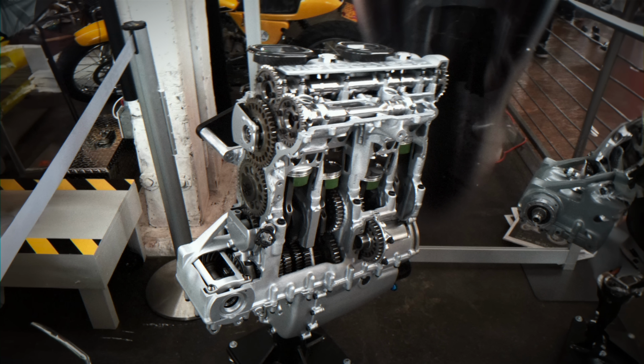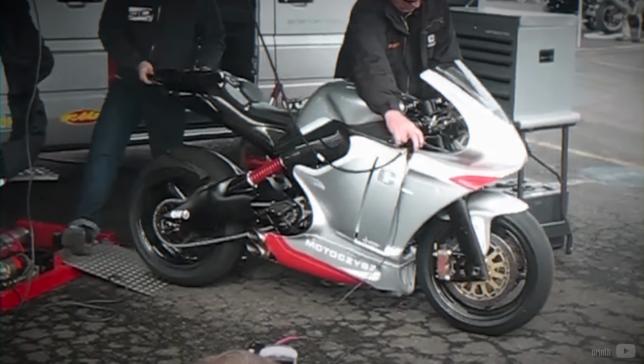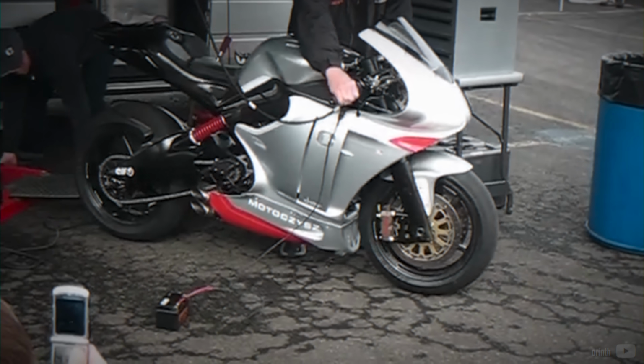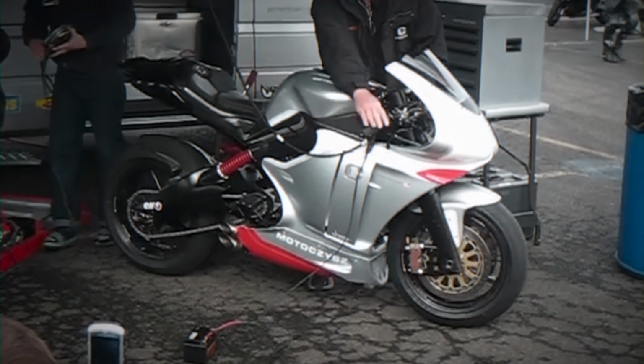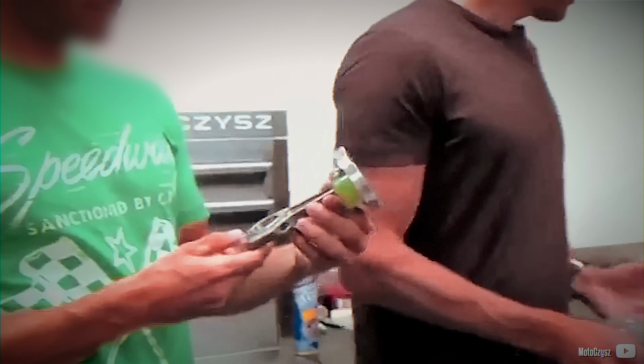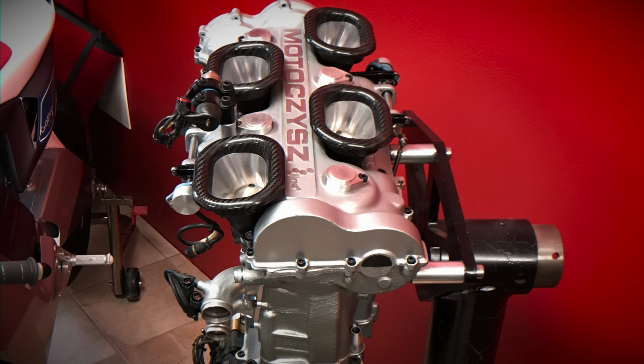The engine's placement and engineering aimed to enhance handling by reducing pitching, such as wheelies common in transverse engine motorcycles. The C1 exhibited remarkable agility, displaying a willingness to lean and stand up. Journalists reported minimal engine vibration at any RPM and observed no rocking of the stationary bike during free-revving. Lastly, an unexpected benefit of this layout was its distinctive sound, described by Michael as a very American heavy kind of V8 sound, blending with the typical V4 burbling vibes.